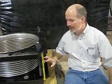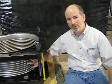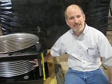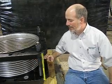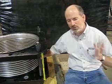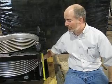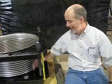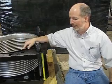You want to be able to cut these things without damaging the bellows. This is one of the more important things about installation — you always got to keep in mind that bellows is easy to damage, or at least easier than a piece of pipe to damage. Any type of a hammer or a wrench that slips down and knocks it in there, then you're going to have to watch one of our videos on what you do about dents. You really should wrap this bellows in something when you're working around it. You can also hand tighten on the inside and do a lot of your pneumatic torquing down to those bolts on the outside.